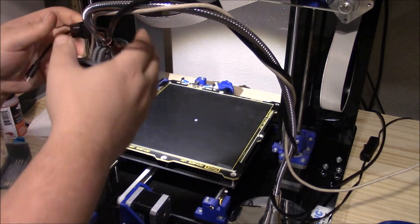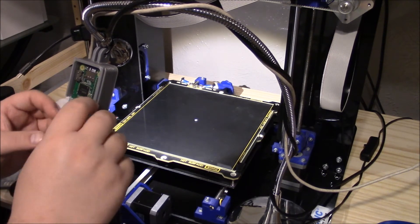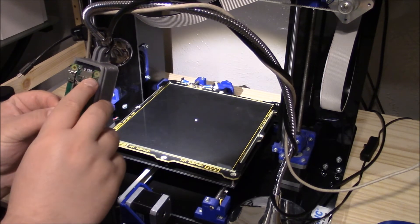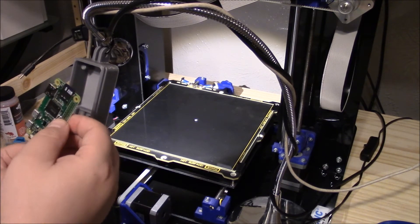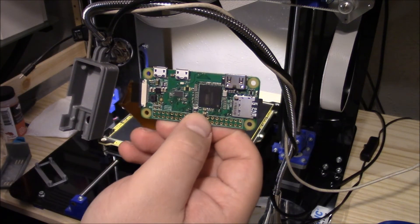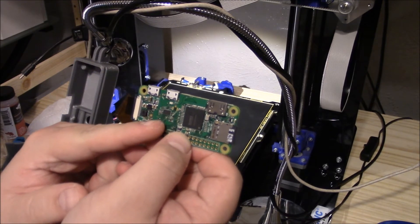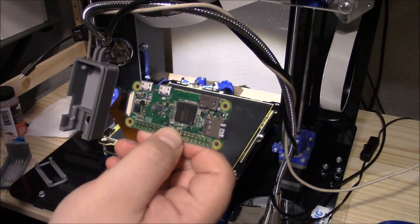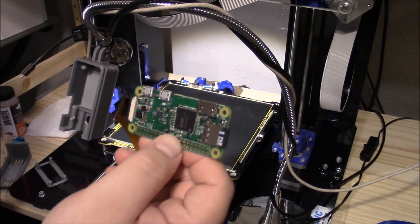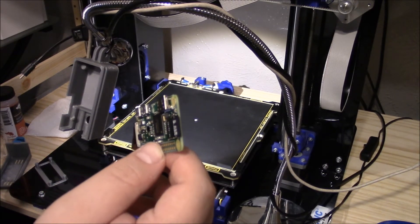On the Raspberry Pi Zero, I'll have a link to this case design in the description. Essentially, it's a very nice screwless design for the camera and Raspberry Pi Zero W. This is a Raspberry Pi Zero W. What's cool about it is it has a built-in antenna and a built-in Wi-Fi chip, and it's $10. So it has Wi-Fi and Bluetooth. It's a 1 GHz Linux computer with 512 MB of RAM. And it's a single core, which is plenty for Octoprint.